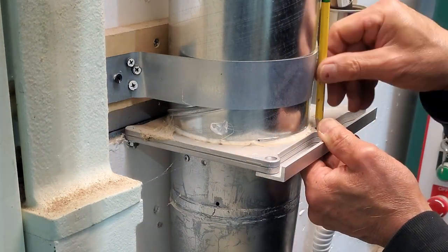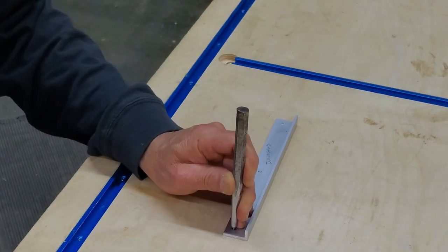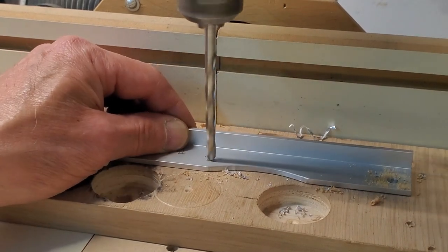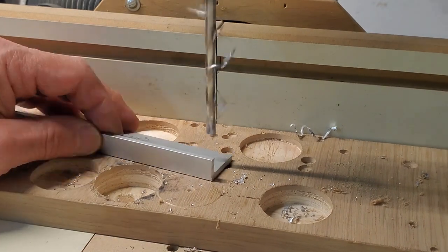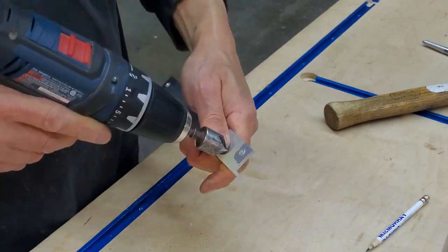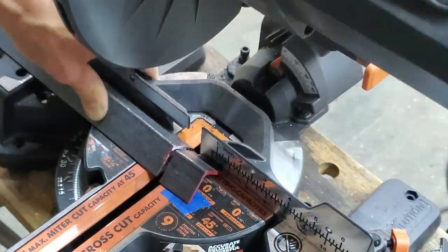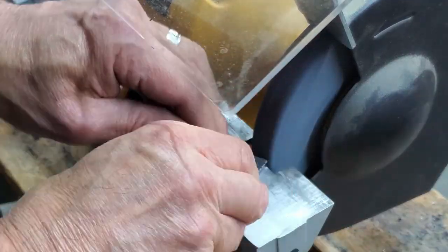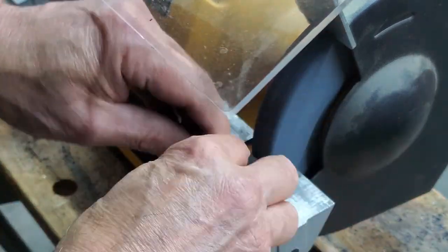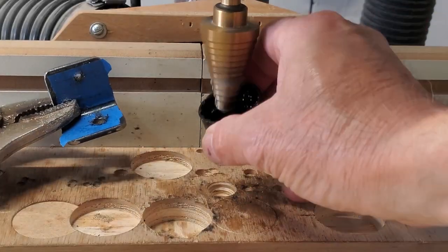Here I'm fabricating a bracket to mount the cylinder to the side of the gate using the existing screws. This half-by-one-inch aluminum angle is the first of two parts for the bracket assembly. One of the biggest benefits of this build is that it's easily adapted to any size blast gate just by selecting the right length pneumatic cylinder, and to any shop circuit — single or three-phase. I've got these set up on four, five, and six-inch gates on both single and three-phase machines in my shop.